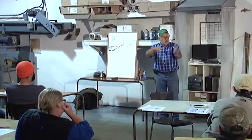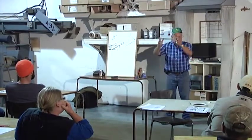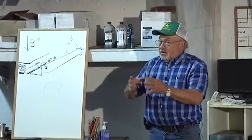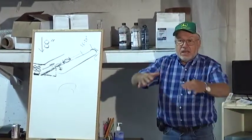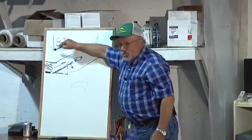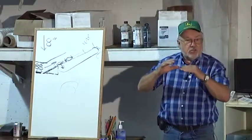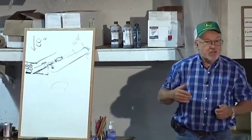Where you're using a side caster to bring extra rows over to get more potatoes on the machine, that changes your ground speed versus digging a row by itself. But the side caster adds potentially some damage because you're handling the potatoes twice. If the chain on the side caster is in line with the bottom knife, that works pretty well — you just have one drop at the back and then a cross conveyor to bring them over. Pay attention to the eight-inch rule where you have that drop at the top of the primary.